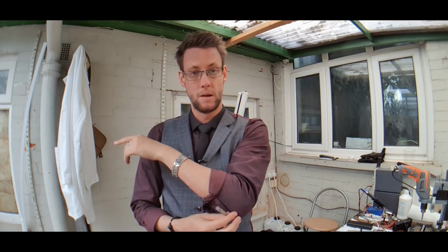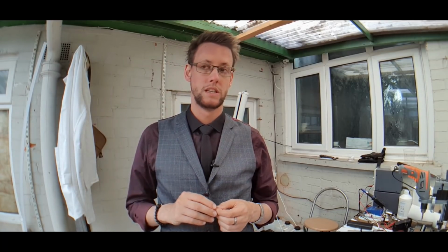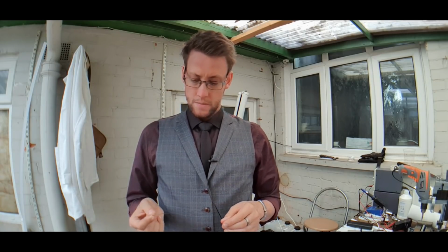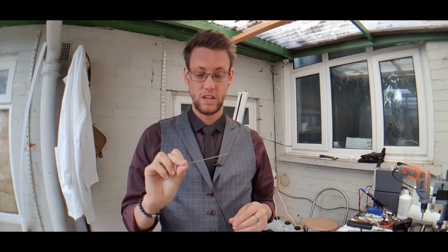And if you monitor the resistance increase of the electricity traveling through it, you can use that as a movement sensor. Not just a movement sensor, but you can also use it as a double check, effectively, against the muscle sensors you've got, to tell them how far the joint is bent. Basically as a kind of false positive check to avoid any miscommunication between the system and your body when you're moving the system. So that's actually pretty useful to have in place.